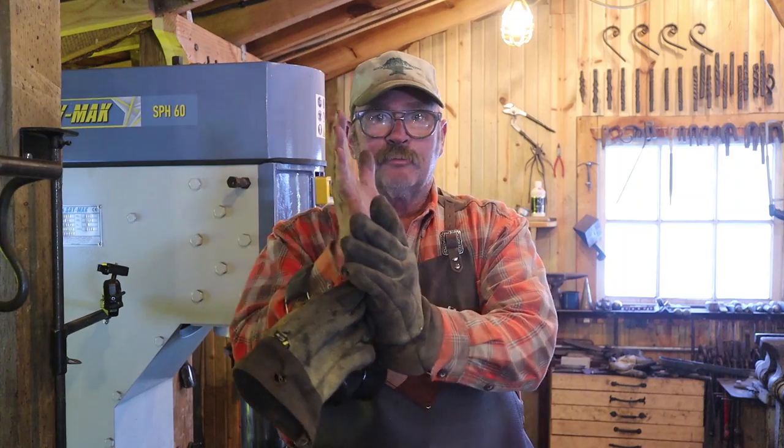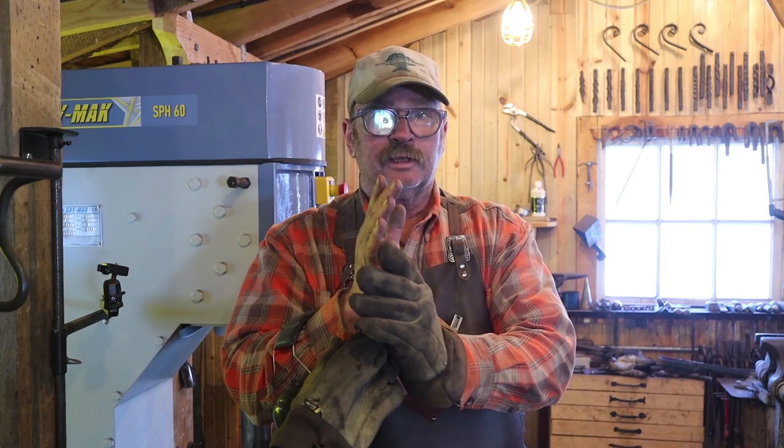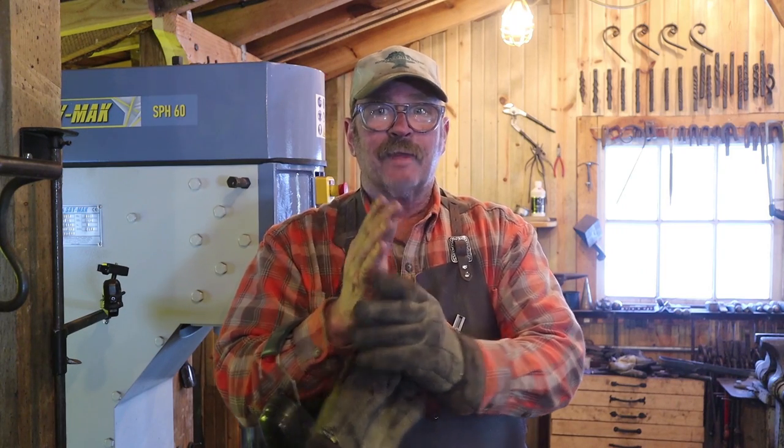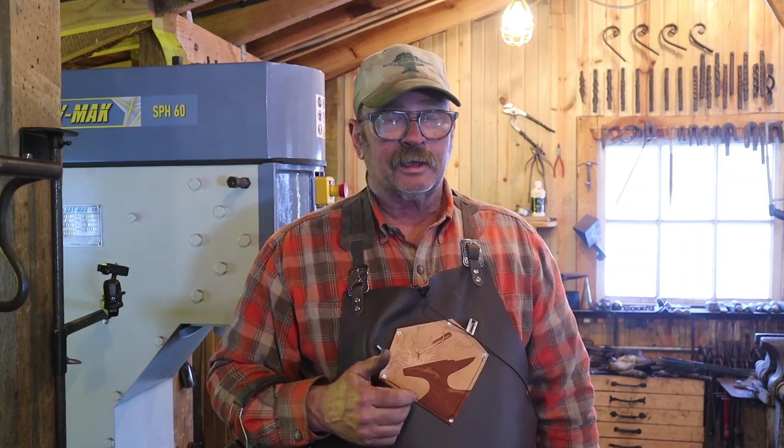If you have an oval punch, it really becomes important to get it lined up with the hammer head just right, or you end up with a crooked eye. This way your eye almost always ends up perfectly in line with the hammer, because it doesn't matter how you orient that round punch. It matters more that you forge the sides back down evenly.